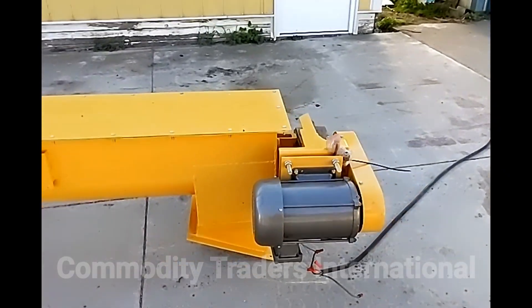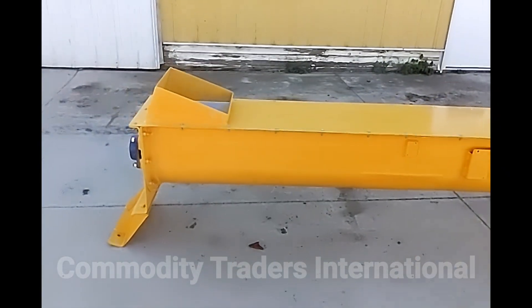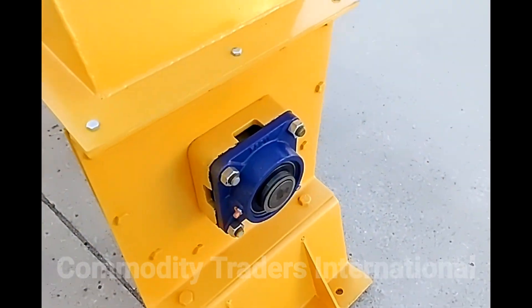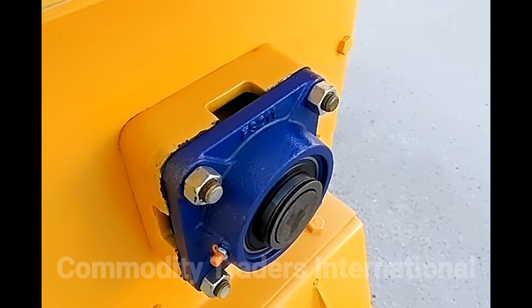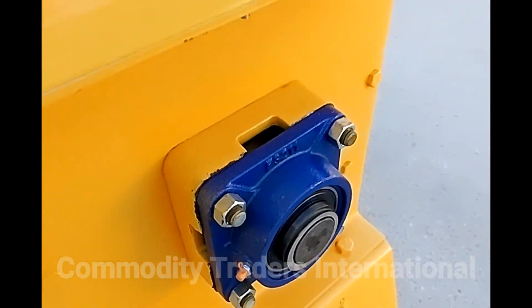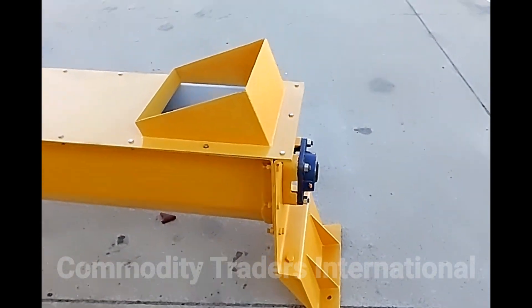This unit has been brought into the shop and completely rebuilt, and it has all new bearings. This bearing is installed and it is a friction fit — this is how the factory installed this bearing. As you can see it is spinning perfectly. That bearing is an interference fit and it does not have a lock collar on it.